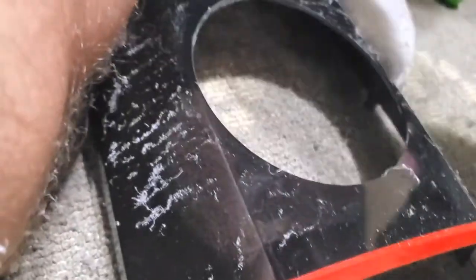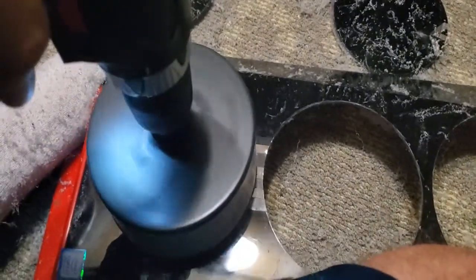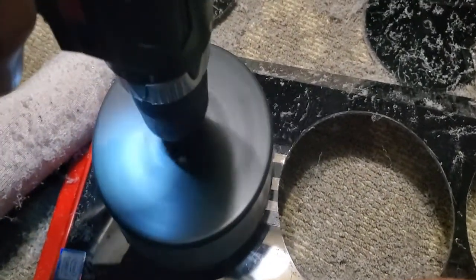The next thing you're going to do using your electric drill and your hole saw: you're going to drill a hole and just make sure you line that drill bit on the arbor up perfectly with the marks you made on the front panel. It's going to catch and bite a little bit if you're coming down uneven, so just make sure you keep going as smoothly as you can with as few stops as possible.